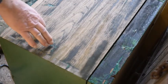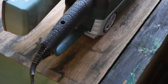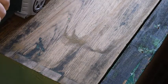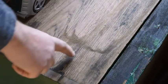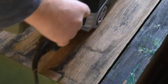On the wood there are sometimes little dents where the paint will stay, but I'd quite like to leave some of that paint because it shows the history of the different things the chest has been through since Victorian times. Always use the sander in the direction of the grain. The grain is running that way — there's a swirl around there and then it comes back down. So keep the belt sander going in the direction of the grain in a forward motion.